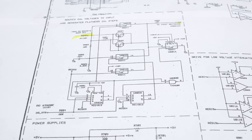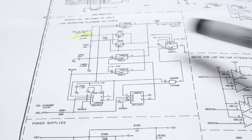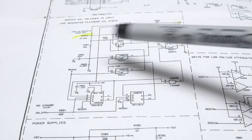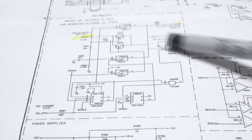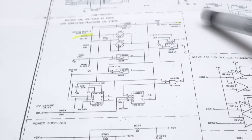Today I'm going to be looking at a FET switch, basically. There's an analog switch here, and on the schematic there is an input that comes from the front panel. When you're in DC mode, it comes through here, and then it gets selected by some switches here, and then it goes off to the measurement device, the dual-slope integrator.